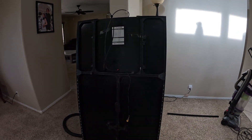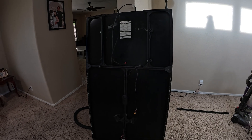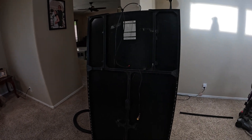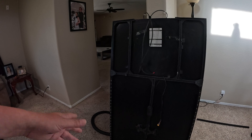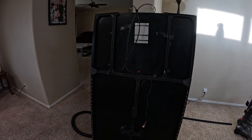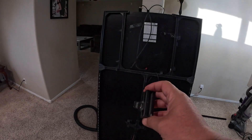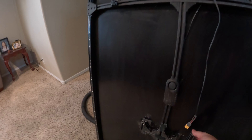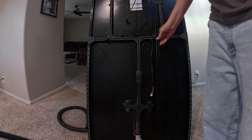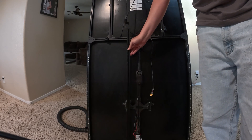I'm going to make a slight modification to the solar lid for the solar trailer. Sometimes when pedaling, the back end gets a little oscillation and the thing starts wobbling a lot, especially if one of the latches comes loose. Unfortunately on this last tour I forgot to tighten everything up with the loctite, and this whole arm came right off. So to remedy that I'm going to add a second rail.